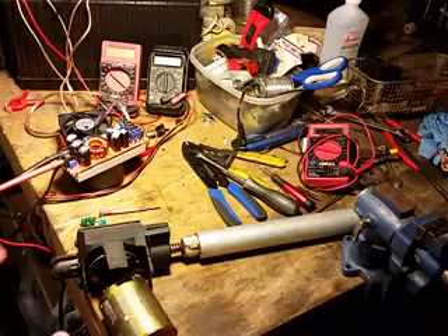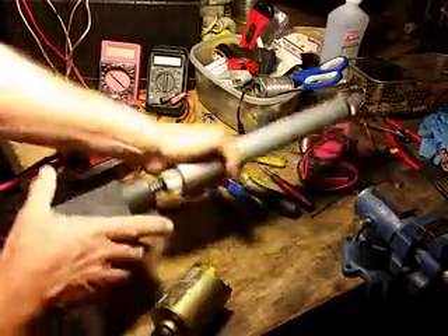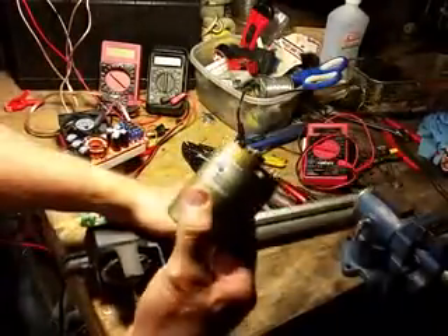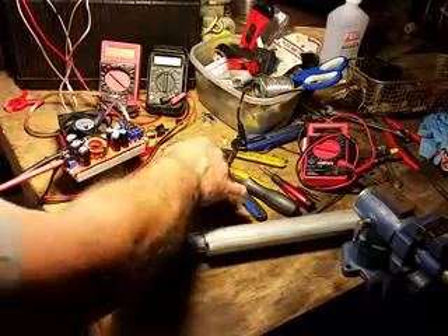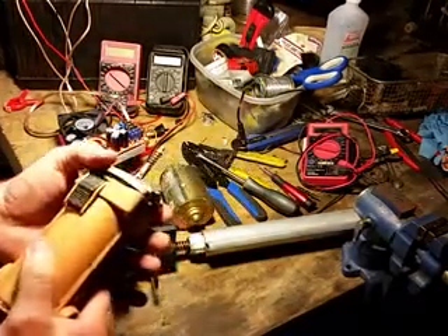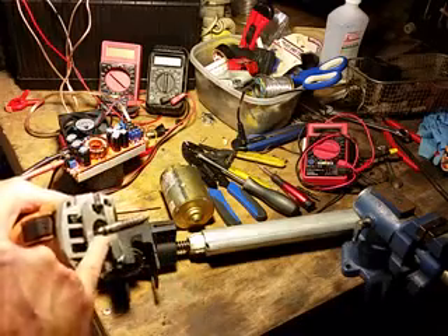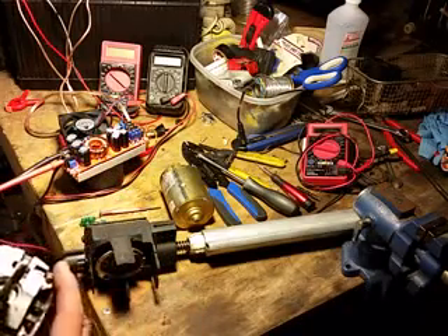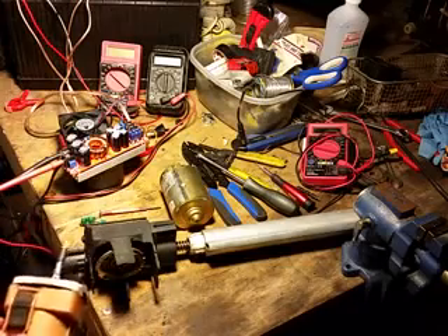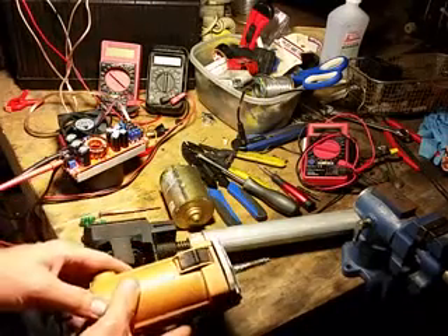The reason why I'm doing this is because I wanted to replace this DC motor that goes onto this screw drive here — it's a kind of worm drive. I wanted to replace it because it wasn't fast enough for the purpose. I decided to use a universal motor found inside an angle grinder. It's really hard to get a worm drive shaft aligned using a stick welder — if you're a TIG welder, you can do it without ruining the motor completely. This has already been tested, works great. This will give me the voltage I need to drive a 110-volt, 4.3-amp universal motor.